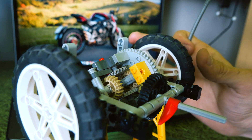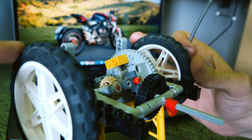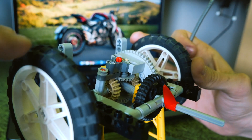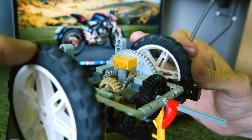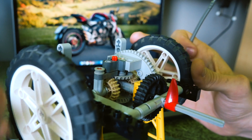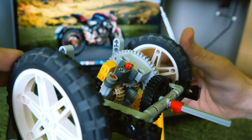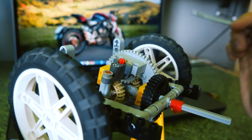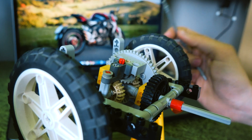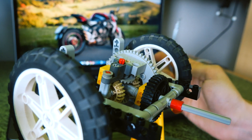For simplicity, we'll just stop this one wheel and turn this one. You can see that the differential turns with this left wheel while the right one is stopped. This wouldn't be possible without the open differential. You can see that power coming from the output shaft of the transmission makes it very easy for the car to travel through a corner where both wheels turn at different speeds.